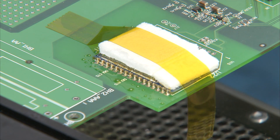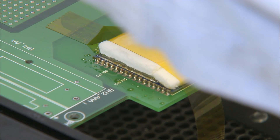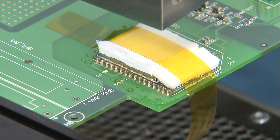Looks good. It's been preheating just like the previous profile — it's exactly the same except for the heat shielding method. It's going to run for 80 seconds at 760 degrees Fahrenheit with a blower speed of seven. Let me input that right now — 80 seconds. Let's start it up.